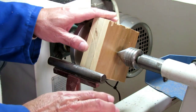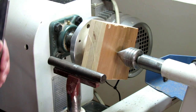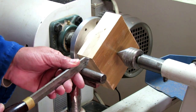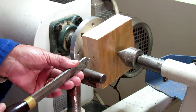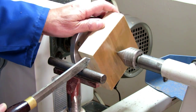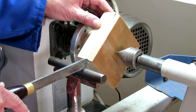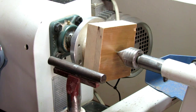For additional support, for the time being the tailstock will remain in place. Now, you can cut the corners round with a jigsaw or on your bandsaw, but if you don't do that, please do not stand in front of the lathe. You will get tear out, and secondly you might push your jigsaw towards the lathe because you're going to turn a lot of air even at high speed. It will most probably grab your jigsaw and rip it out of your hand, and there will be blood.